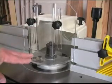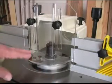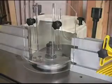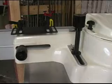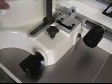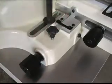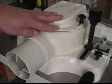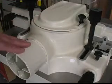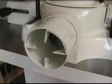When adjusted properly, this shield does a good job of keeping your fingers away from the bit as well as protecting you from a lot of debris that can be flying around. All the fence adjustments are tool-free and done with these large, easy-to-use knobs. The outfeed-side fence has this adjustment system for moving it forward and backwards for jointing operations, including a scale so you can precisely set the offset. The housing at the center of the fence is all cast iron and has this four-inch diameter port at the rear. These fingers inside the port help break up the large clumps of debris that a shaper can make.